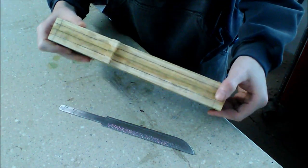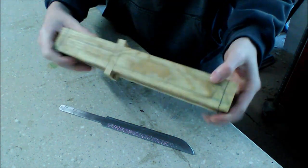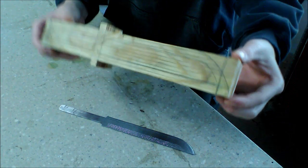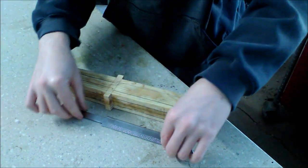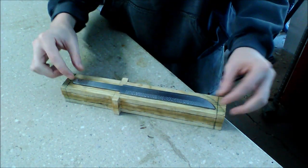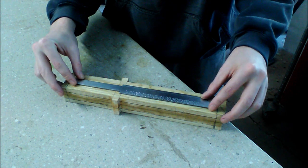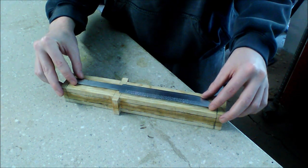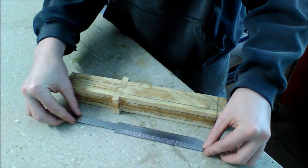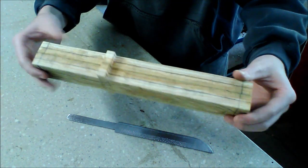Here we are now. I've done a couple of things off camera. I've taken a bit of glue on the end of my finger and run it along the seam here just to hold the two pieces together while I carve it. And I've got the two chiseled outsides against each other, so the cavity is on the inside now. I've also drawn a line on for the blade just so I don't go too far. To do that, I put it on the top like this and traced around it. But I am a little bit worried because I can't see the chiseled out part, obviously. So I've sort of guessed where this was, but I'm afraid it might be a millimeter this way or a millimeter that way. So there's a possibility that once I do this, it won't line up. So a little bit worried about that, but as always, you just gotta get started with it, I guess. So time to start making this into more of an actual blade shape.